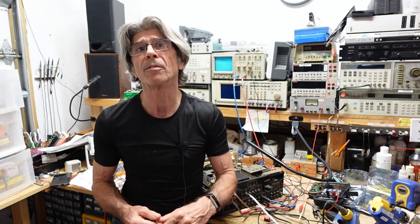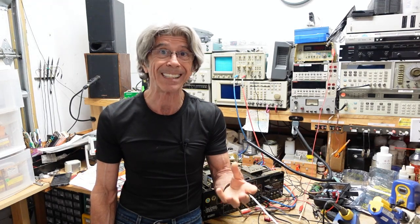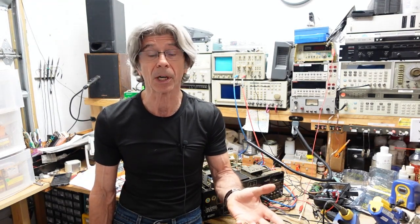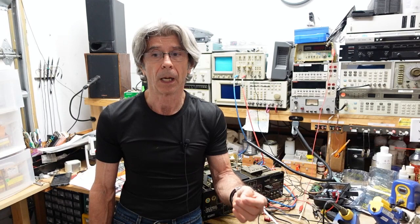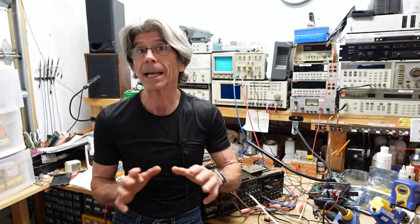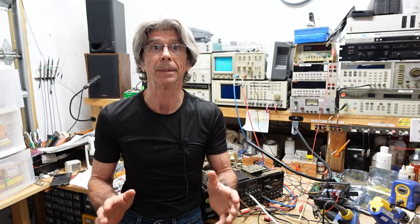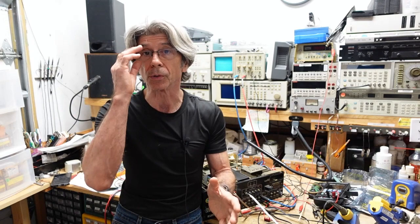And if you recall, we found the main power fuse wrapped in foil. Now, did this allow more damage to be caused? Because it never did blow. I guess we'll really never know the answer to that, but it brings up a really good point, and that is, if you buy a piece of used or vintage audio equipment, it's a good idea to check the fuses.